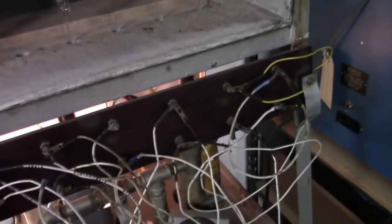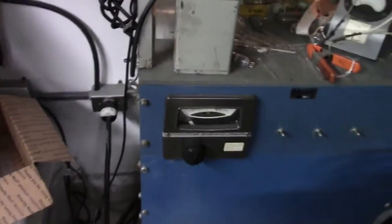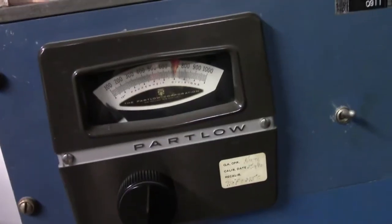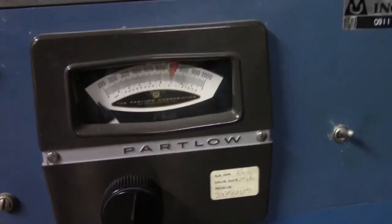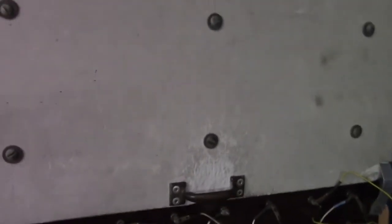We'll pick the heat on and come back in about 30 minutes or so. The heat-up and cool-down cycle is about 90 minutes. I don't do a true anneal on these because we use the tub annealer. I bake these at 700 degrees Fahrenheit, which is plenty enough to drive off the water vapor and pull most of the binder out of the cathode material. Sometimes I'll go ahead and do a quick RF bombardment before bake, but I sprayed the cathodes really heavily on these as an experiment, so I prefer to let the more gentle heat of the bake-out oven do its thing, because the RF bombarder heats so rapidly that it could blow off the emission coating.